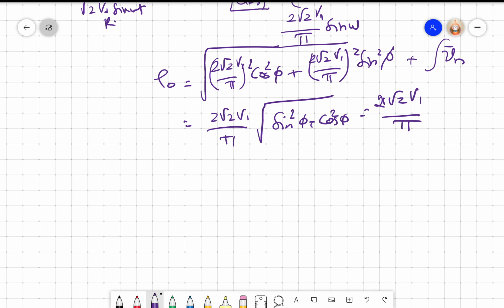Unless there is some old company with old models, they still use amplitude demodulators, but today's variable reluctance type sensors, as well as LVDT sensors, people simply use the synchronous switching type PSDs. Okay, so how do they use it?